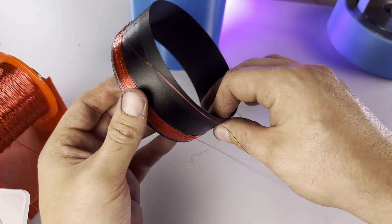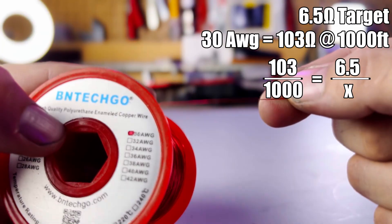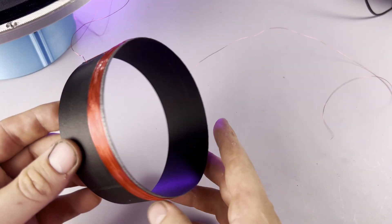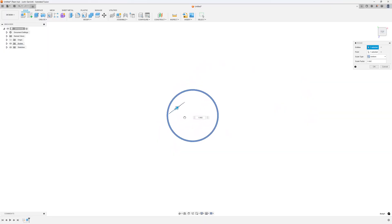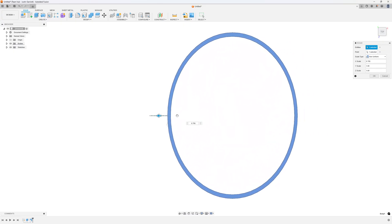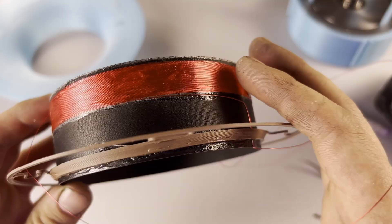The coil is the largest one I've ever used — it has to fit over our 90 millimeter pole. We're shooting for six and a half ohms of wire in two layers; some simple math gives us the exact number of windings. Load the former on the hub and start winding. I feared this would happen: as the former gets larger, the concentric stability fades, leading to an undesired elliptical shape. In testing I found this to be a result of too much tension on the winding or a loose-fitting holder. We'll up the holder's size by a fraction of a millimeter and wind a touch slower to reduce tension. With those fixes implemented, we have a somewhat usable coil.